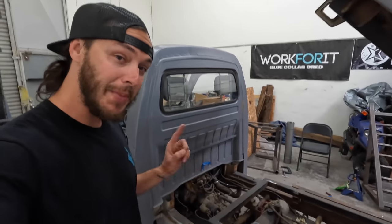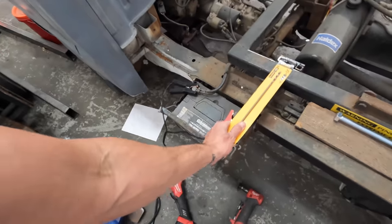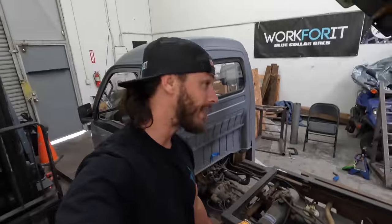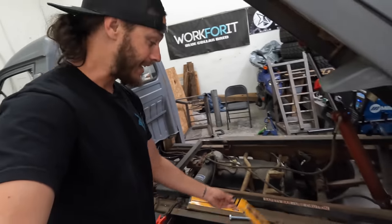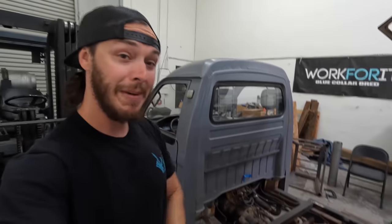So my master plan here is I'm going to lower the bed. I'm going to take this super long 3/16 bit. I'm going to use that as my pilot bit. And assuming I can hold this straight, I'm gonna go all the way through all the layers. Then lift the bed and I'll be able to drill this separately from that. Because obviously trying to drill through 6 inches with a bit that is barely 6 inches long isn't gonna be any fun, especially considering the bed has to be down and it's a real tight space to get in there to drill. So hopefully my plan works.